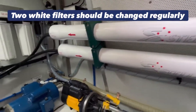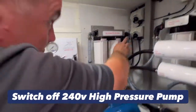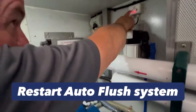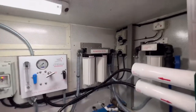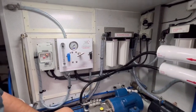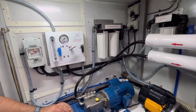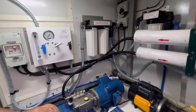The rule is always: make good water in clean water. So we've wound off the pressure, we're going to switch off the high pressure pump, then switch off the feed pump or boost pump — system shut down. Then we're going to start the automatic flush cycle. The system is now flushing; you can hear the fresh water pump kicking in. That'll run for three minutes and run clean water across the equipment, then set a timer for the next seven days. This keeps the equipment — mainly the membranes — free of biofouling: bacterial stuff, funguses, that sort of thing that can grow if you leave salt water in there. It's maintaining the life of the membranes, which should give in excess of eight to ten thousand hours of use on a well-maintained boat, which is not insignificant.